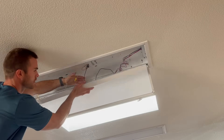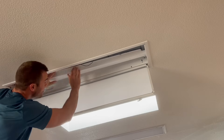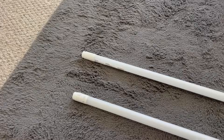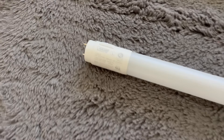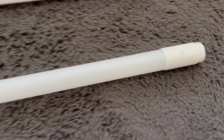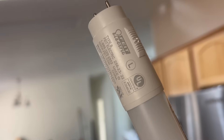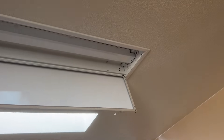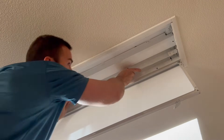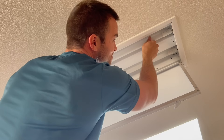We can now start putting things back in place, starting with this metal wire covering. Just pinch it together and fit it into the upper tabs, making sure all the wires are securely inside. When installing the new LED tubes, one side will be labeled with an L for live, and the other side will be N for neutral. Make sure you put your live end on the same side where you had all your red and blue wiring. Line up the pins on either end with both tombstones, then give the whole thing a half turn and you should feel it click into place.